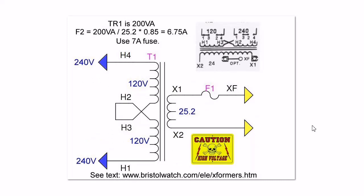Here are my connections for 240 volts. In this case, H2 is wired to H3 as shown on the label. You have to wire this correctly because now the windings, while they are in series, they have to be wound in the same direction. If you had one of the two windings wound backwards, it would basically cancel out the magnetic field and you would blow the circuit because with no inductive reactance, it's a dead short. The secondary output is exactly the same as before.